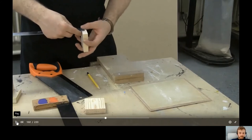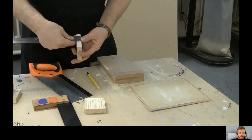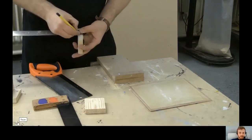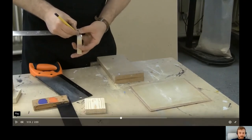Next, find the middle because you need to cut down to the middle and then chisel away that section. Find the halfway point on the piece of wood along the cut section — the width is usually about 18mm for this type of wood, which is 6-by-1. Press your thumb against it and mark the halfway point.